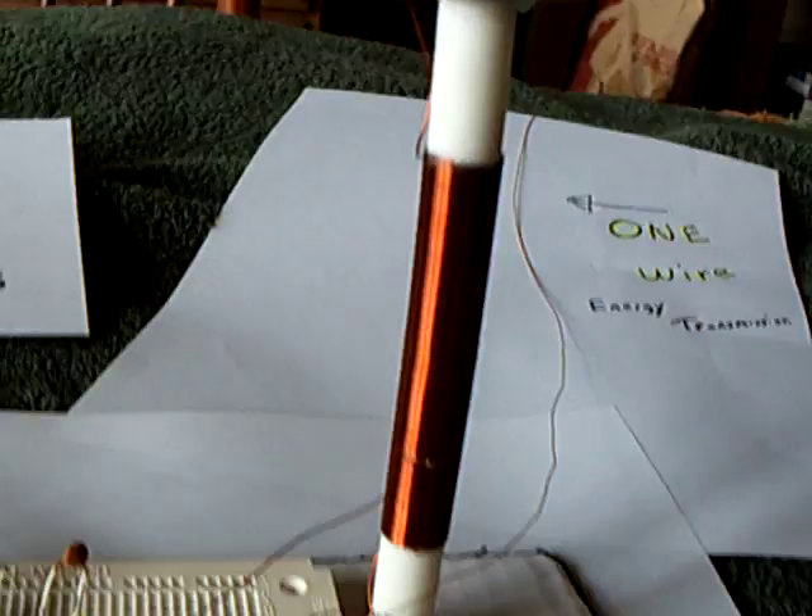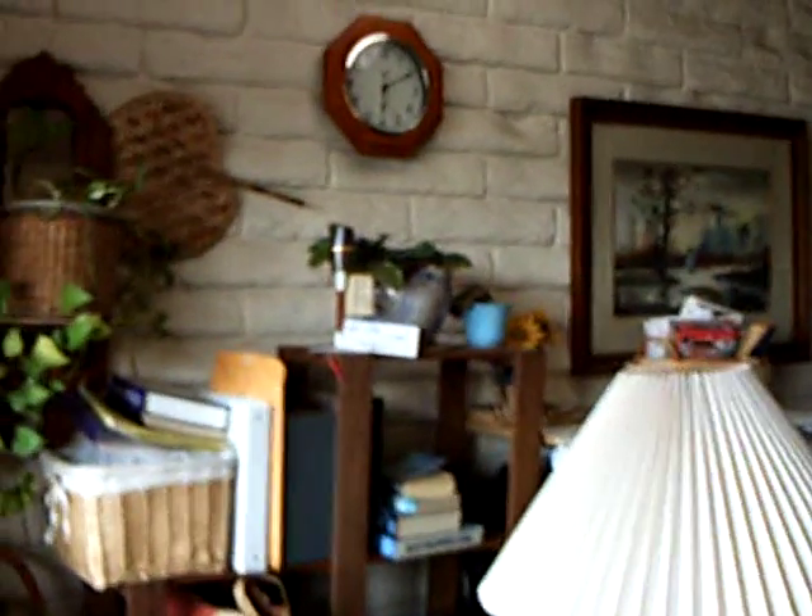The parts are pretty much identical to what he specified, including these little towers. These little Tesla-like towers are really neat, and I'm having a lot of fun experimenting with them. I'm using a brass tape I got at a craft store to attach the attachment points — you can solder to it, which is really nice. The tower on the far side is the receiver tower, and that receiver tower has 27 LEDs rated at 3 volts each. The tower winding is exactly like the one here — an identical coil arrangement.